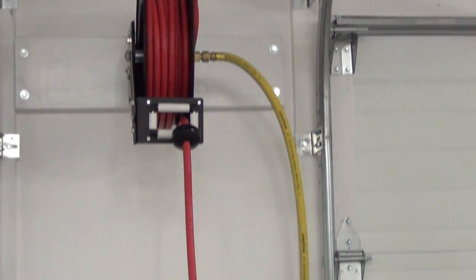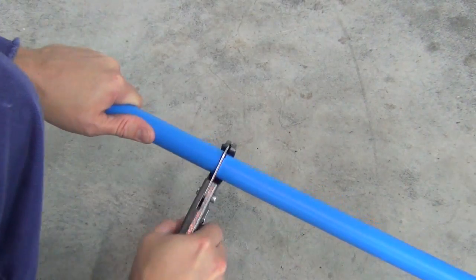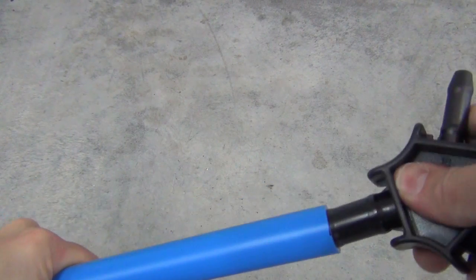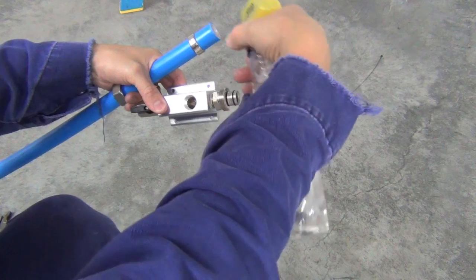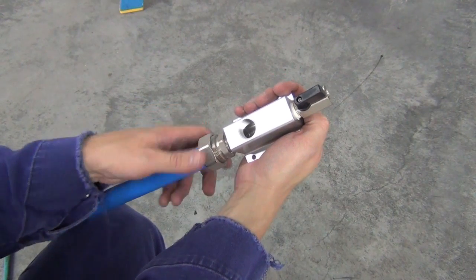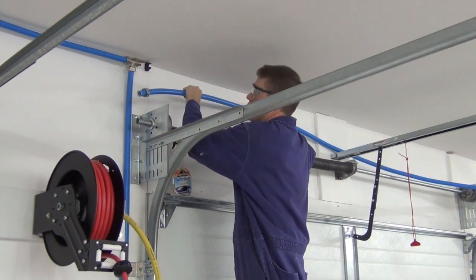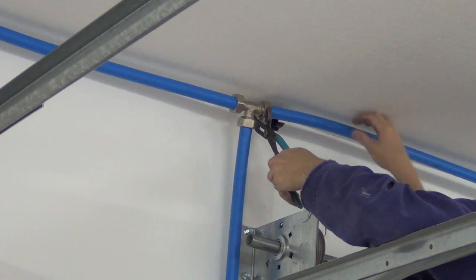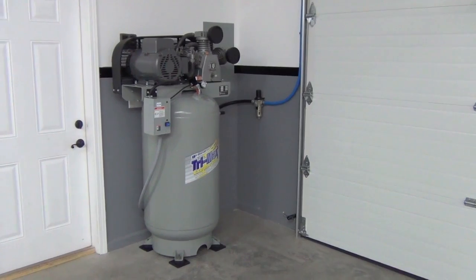Now it was time to run my first drop from the ceiling down the wall. After careful measuring, I cut the tube using the supplied tool. You can see the aluminum sandwiched between the two layers of HDPE. After making a cut, prepare the pipe for assembly using the provided tool — it expands the piping slightly and cuts a nice beveled edge on the end. Then spray a little soapy water on the end and insert it into the fitting. Make a quick reference mark and then tighten to three-quarters of a turn — that's all there is to it. After that it was time to install my second air drop using the included T-fitting and running the line over to the next bay. After connecting all the lines up, I mounted the air drop to the wall and connected my jumper hose which connects to my hose reel.